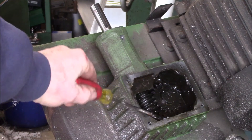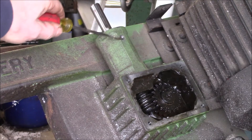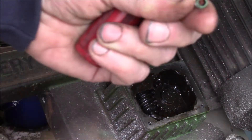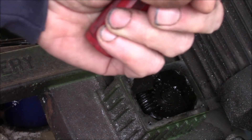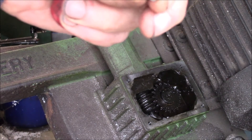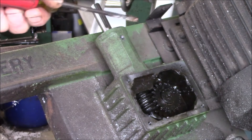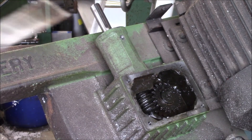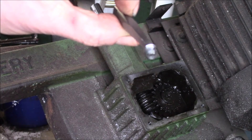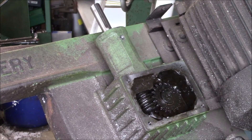Making a little more progress. I got the old gear oil sucked out of the gearbox. One thing I was having trouble with — there was a set screw here. I unscrewed it and that's what came out. Looking closer, it had just broken off at the threads, right at the bottom of the hex socket. I got a drill bit in there and drilled a hole for one of these square tapered extractors, jammed that in, and was able to get the rest of the set screw out. I couldn't figure out what that set screw was for — it was a longer set screw and it just broke off on top.